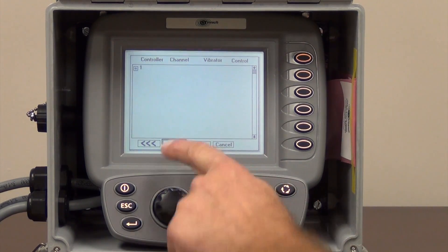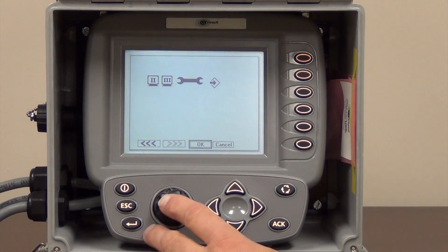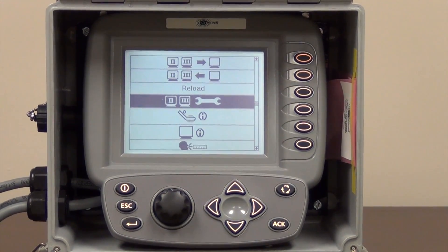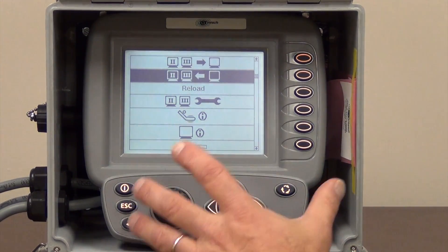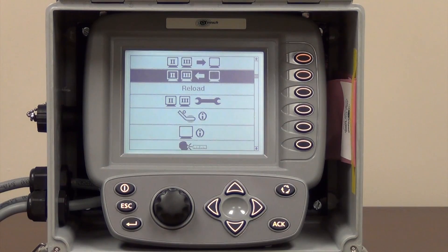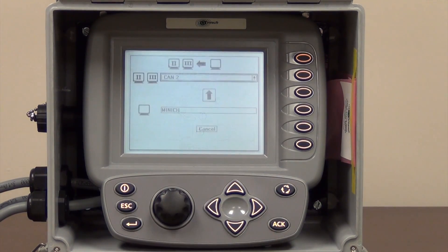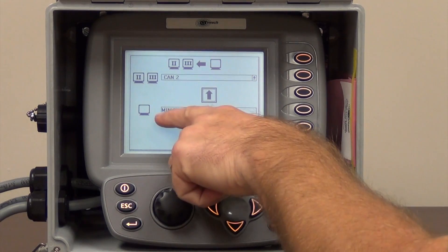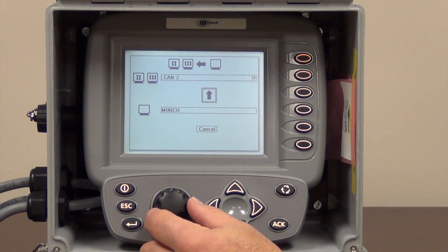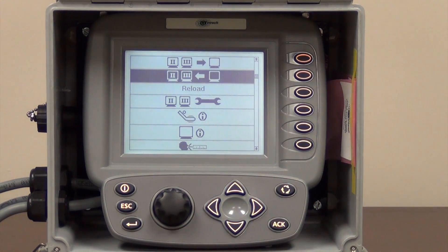Right click your arrow twice to the arrows at the bottom of the page again and we are done. We are happy with our configuration, we got the OK box highlighted, we are going to press it and accept the changes, and then we need to save it back to memory. That information is in the monitor and the other little icons to the left means we are going to save it back to memory inside the monitor. We are going to highlight that, press it, open that page up, and we can see where our configuration we just built says Minic, so we need to transfer that to memory. We highlight the arrow in the center of the page, press our black knob, and that saved it back in memory.